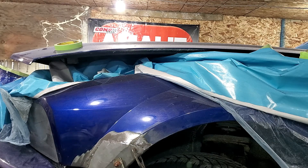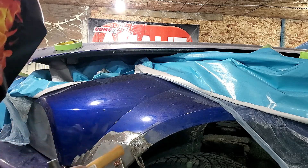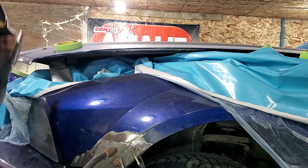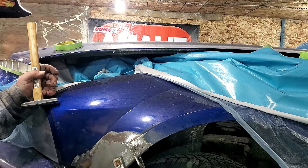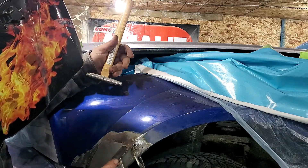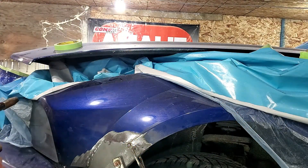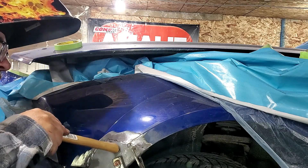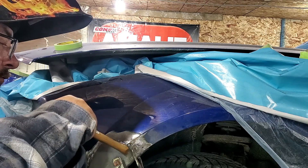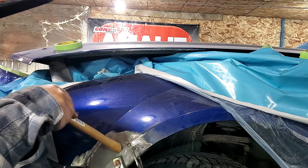So I have a MIG Pac 180. I'm going to start my settings on B for heat and number three for wire speed. Always, always start with your patch in the center. Make sure that you have your corners where you want them, but start welding in the center. And when I punch my lines in, see how everything wants to turn nice and easy.